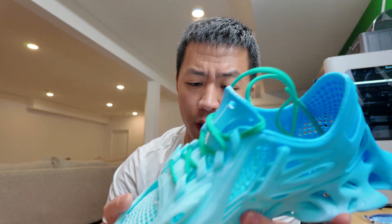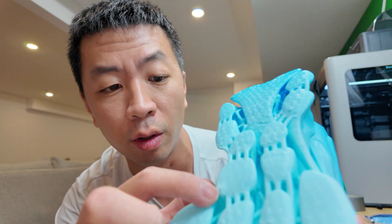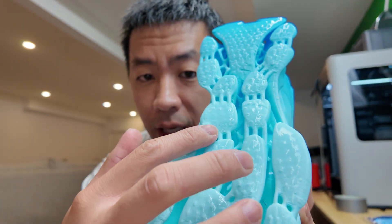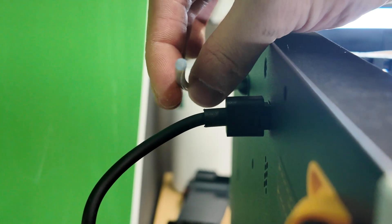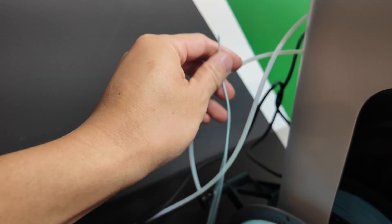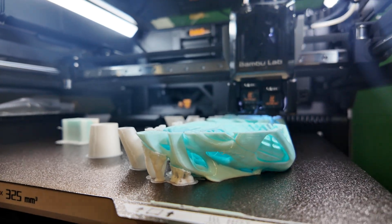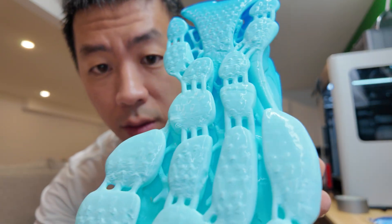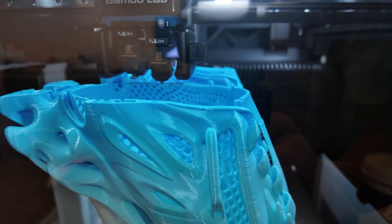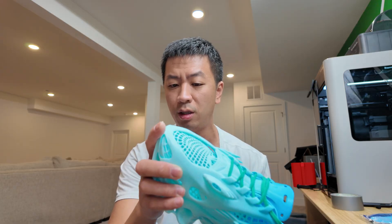So there we have it — 3D printed shoes. Let's talk about the print quality real quick. I'm just doing an observation and there were a lot of issues with the print quality. A lot of issues with the overhangs. If you look at the underside of the shoe, all these little overhangs are just sagging. I'm not sure if that's because of the way my TPU was feeding from the AMS into the printer, or if it's due to a speed setting or not being in a dryer while printing. I kind of just YOLO'd and printed this to see how it would come out. Overall though, for what this is, I think it came out pretty nice.